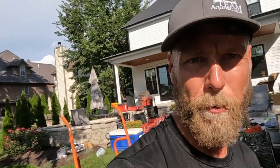What's important to remember when splitting the volume of the pump is that you're putting the ball valves in the proper locations. So what we're gonna do is put one before we hook up the plumbing to the spillway that will feed this left waterfall behind me.